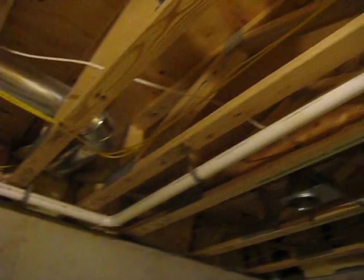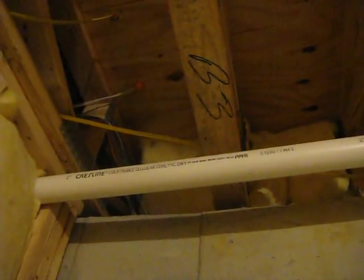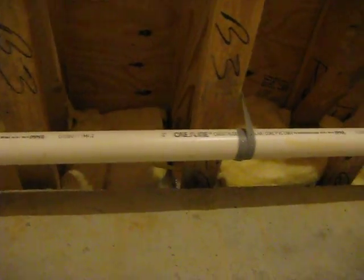So I'll have 2 recessed lights up here, down onto the workbench so that it's well lit. You can see the ejection pump pipe here goes up and then through the floor joists in the ceiling, but for some reason, I don't know why, the builders did not put it above the floor joist. They actually put it below the floor joist. So we have to, using an elbow, raise that ejector pipe above the floor joists, so we can actually finish the ceiling without that pipe being in the way.